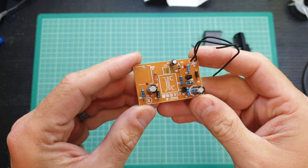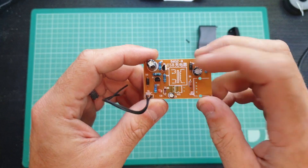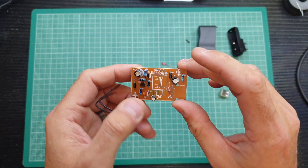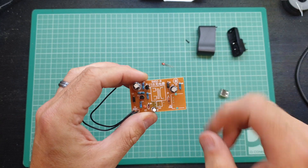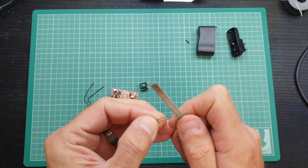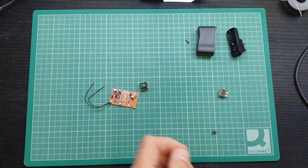I'm back. As you can see I've put in all the caps, resistors, the two transistors, and all the diodes — the Zener diode and one other. They were quite difficult to see which was which; I had to use my little lens retrieved from an old projector to help. All the thing — the only thing left to really put on now is the little transformer, the opto isolator, a USB socket, and the LED. Looking at the LED, the legs are all tarnished so I'm just using this little needle file to take that tarnish off.